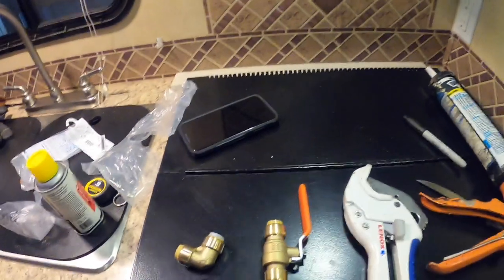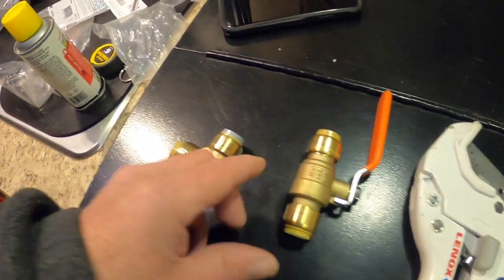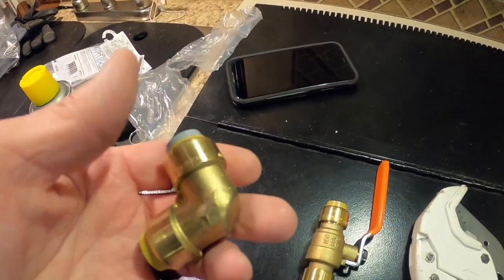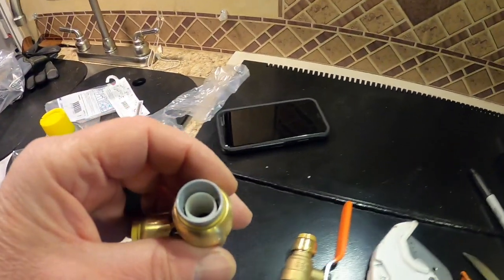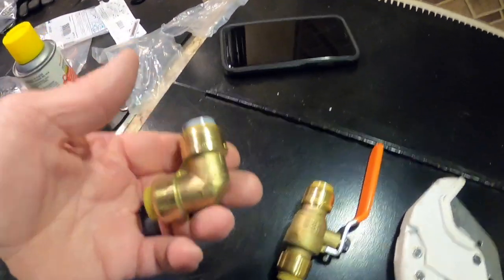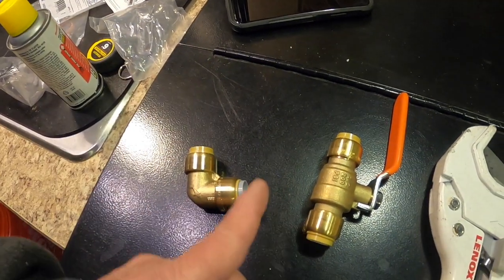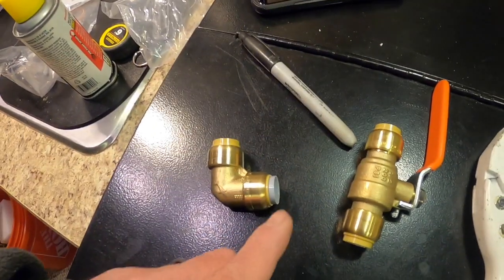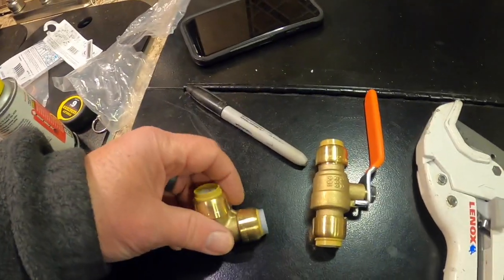This also comes with the poop shooter - get that out of the way for now. These are the SharkBite connectors - I love these things. They're called SharkBite because there are shark teeth down in the center. I have the PEX tubing here - that blue stuff - and usually your camper is going to be half inch, so you'll need half inch SharkBite connectors. What you do is mark the PEX with a Sharpie, then just shove it in there as far as you can get it - goes in about a half inch, grabs, and seals really well.